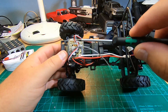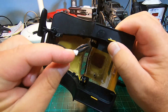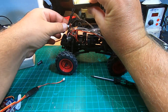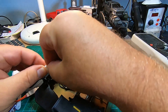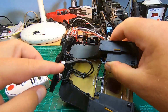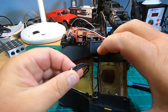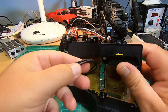This board has lights, and mine came plugged with a three pin port, so we can switch lights on and off. But there's a second port - a two pin plug. If you plug this to the board nothing will happen to the fog light ports - it will not work. However, the LED does work. It's the same LED as the lights we use with the three pin adapter. It doesn't work because the polarity is reversed. If you plugged it to the fog light port and reversed the polarity it would work, but then you shouldn't plug both in parallel.